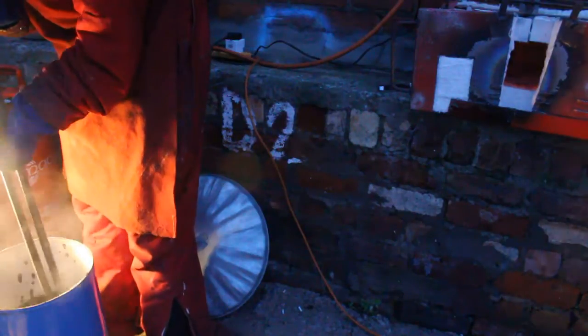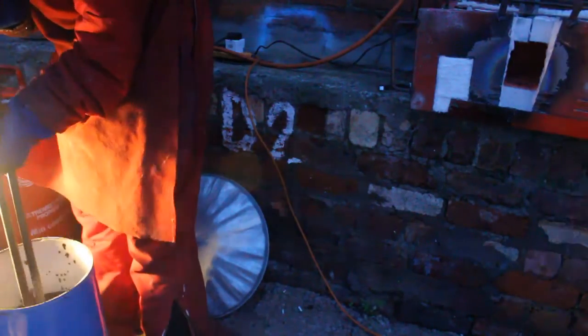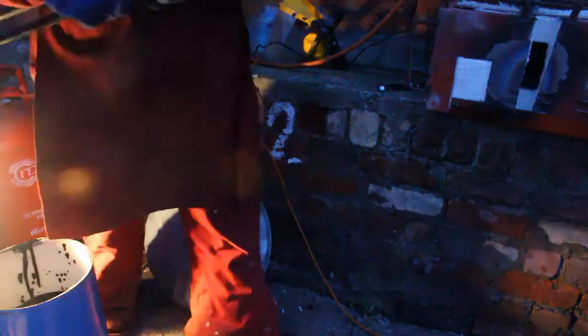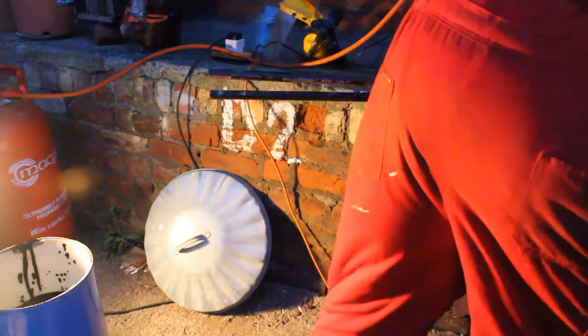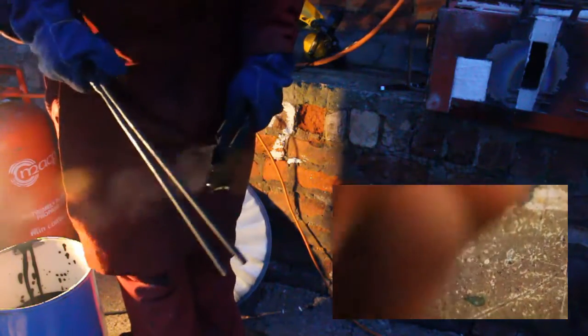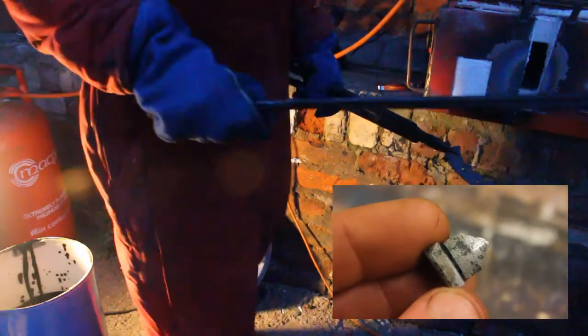The metal was kept moving under the oil until it stopped smoking. I tested for cracks by listening to the sound it makes when struck. A dead sound would reveal a crack. Testing revealed that water quenching the steel would result in cracks. The next stage is to clean off all the black gunk and shine up the surface for tempering.